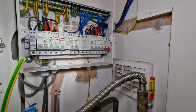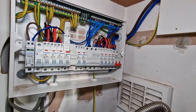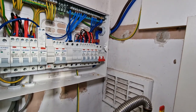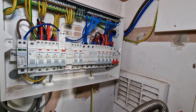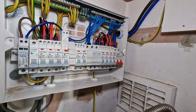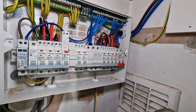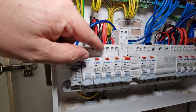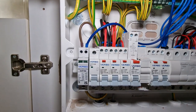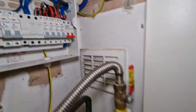You can see we've got the board in now - Nathan's done this one. He's in his second year of his apprenticeship and he's done a really tidy job. You'll see we've got the earths all coming into the back, the neutral fly leads in, and our final circuits looped straight over. We've worked with the lengths we've got so we haven't extended the line and neutral, though we did have to extend a few of the CPCs. I've popped an old RCBO in just to show the height difference, and we've managed to get this final circuit into the mini RCBO where we wouldn't have done that on these older variants.